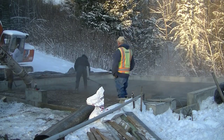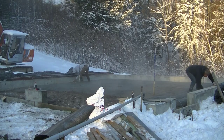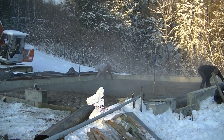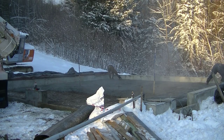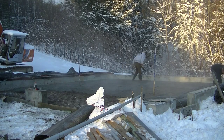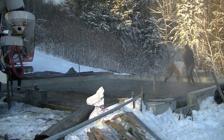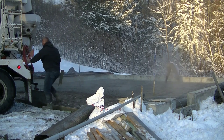You can see the steam coming off it from the cold weather — it was about 15 to 20 degrees when we started pouring, supposed to get up to around 32 this afternoon. There's a bunch of trees blocking the sun so we won't get much solar gain today. Right now Luke and I are maging our edges to that chalk line as our outside grade. I've got a grade pin in the middle with a nail through it as our center grade, and we'll strike our wet pads off that — we wet screed everything, no pipes or two-by-fours.